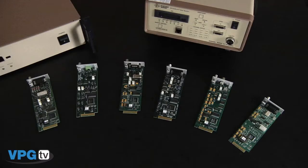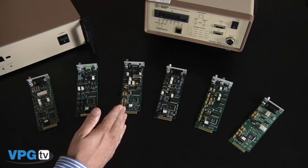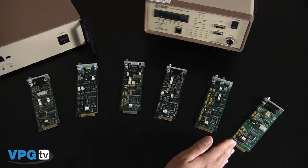For those customers needing more speed, we created the System 6000. The System 6000 is a higher speed version of the System 5000 which shares the same software and interface card. However, the scanners are designed to allow measurement speeds of over 10,000 samples per second with simultaneous sampling of all channels. Similar to the 5000, the System 6000 consists of a scanner and offers a variety of input cards including the strain gauge, thermocouple, high level, LVDT, piezoelectric, and digital tachometer card.